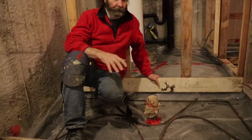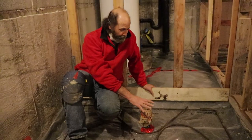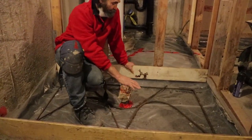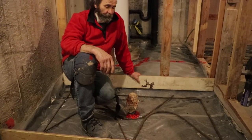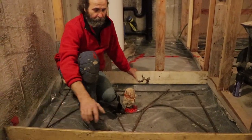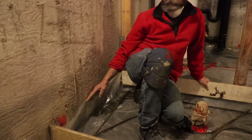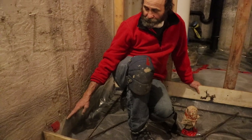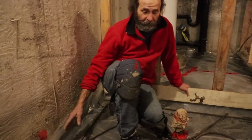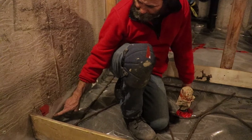The drain is rough on the center. If you look at it right now it doesn't look to be on center because the door is going to be on this side. Once we install the sliding door, it's going to sit on the center of the shower. Right now it looks a little off because we deducted a few inches for the door on this side. The poly comes a little bit higher than the concrete — this prevents moisture from coming up. Once this is done we just cut the poly off or leave it; it's going to be covered anyway.